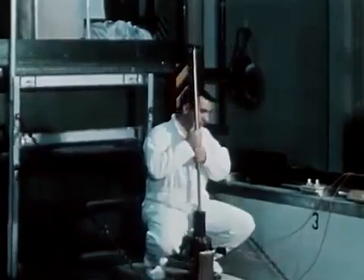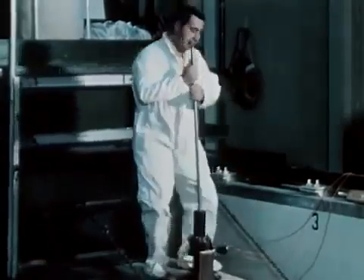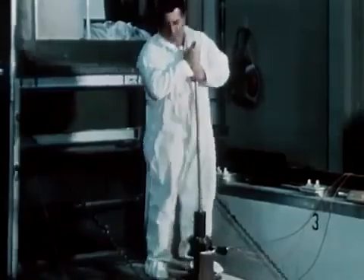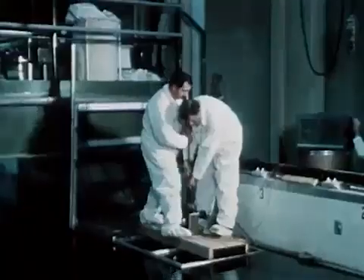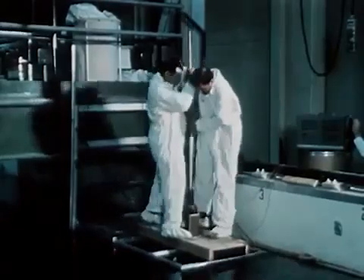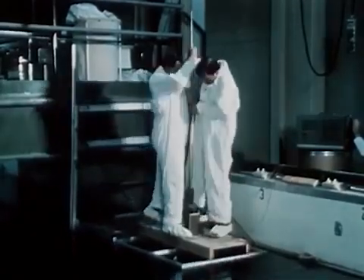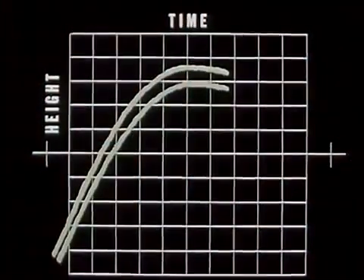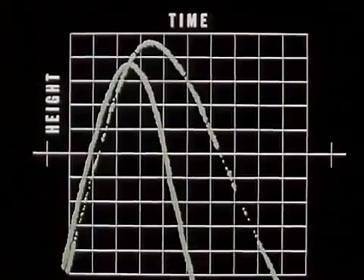To test empirically that this is possible, a control rod drive mechanism was assembled over a pool of water and attempts were made to withdraw the rod with reasonable efforts and maximum efforts. Similar tests simulating stuck mechanism conditions were also conducted. All data were recorded on an oscilloscope.